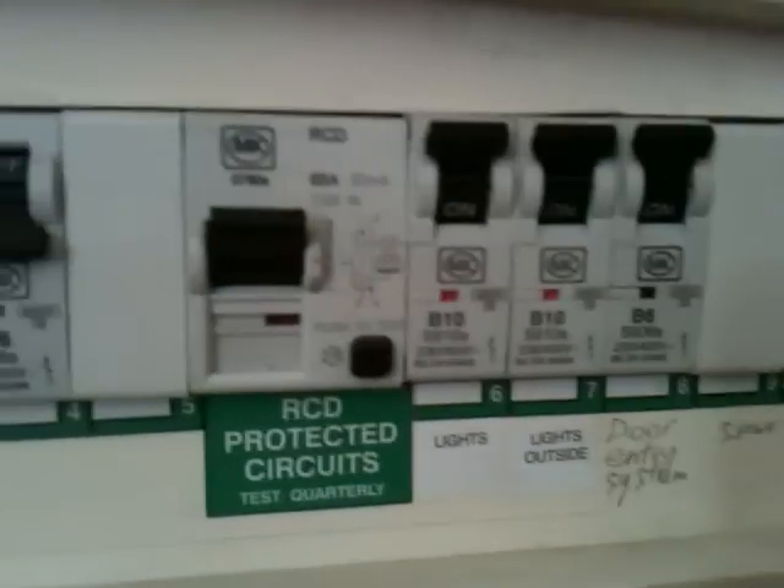Let's come back - is that all? No, it's not. We found something else down here. This is the landlord meter. Remember those Henley blocks splitting off supply? Well, that's where they're going - the landlord lives in number 5. And this is their sub-meter for the communal area: 724 units. The corridor lights probably don't consume much, so it's a bit excessive having this 20 to 80 amp meter. There's a second distribution panel here for lights, door entry system, and a couple of residual current devices in view of the use of ground floor sockets.